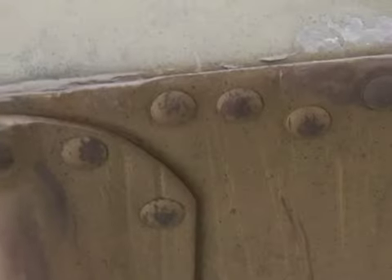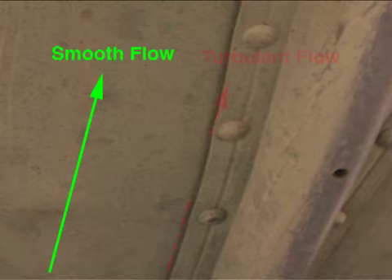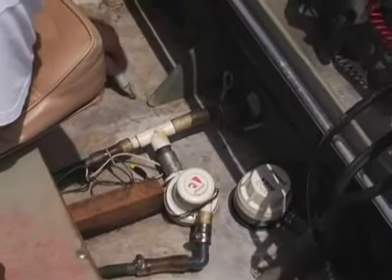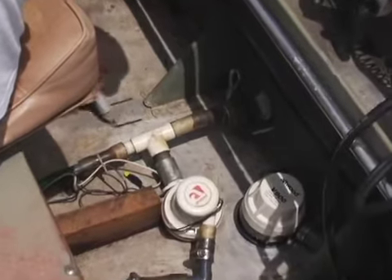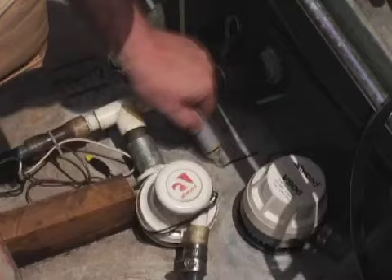With aluminum hulls, this area may not be as obvious. Boats like this one with rivets along their bottom side create more turbulence in the water, so finding an area of smooth water flow can be a challenge, but it is possible in most cases. Select an area within one foot of the center keel of the boat and directly in front of the bottom corner of the transom — this area is often near the drain plug.